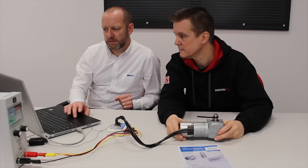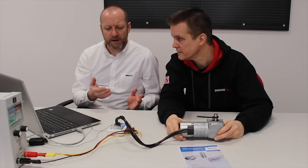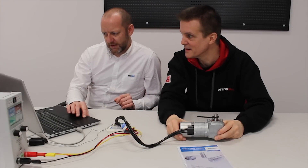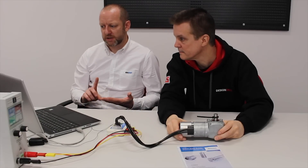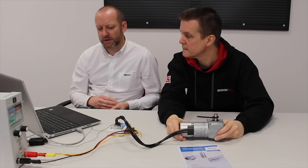I'm going to do a velocity mode example and expand on the factory mode which we were running earlier through the controller. So you've got a sort of movement curve there for acceleration, speed, and deceleration? Yes. I can now start changing parameters - I can start changing the three fixed speeds that we saw earlier. Here are the factory defaults, and I can start changing acceleration and deceleration at startup in both clockwise and anticlockwise directions.